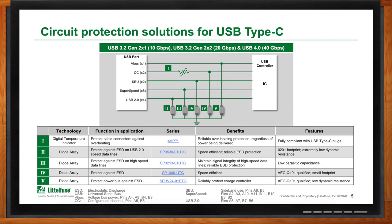Looking at this table from the bottom up — at Roman numeral V — we see an ESD protector for the power lines on the USB-C port. This one is optimally sized for a power line that can have up to 20 volts. Your typical ESD device is only capable of about 5, 6, or even 12 volts of sustained power. In this case you need it to be at least 20 volts, so that's where the SPHV24 comes into play — it can handle all 20 volts and accurately protect against an ESD event.